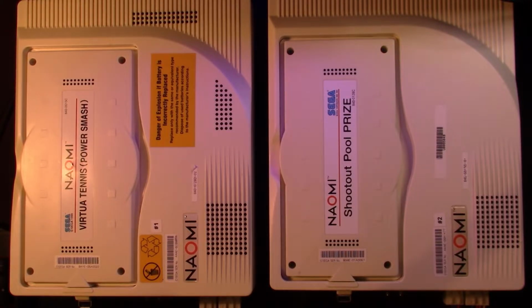That was one of the reasons I was thinking of, for the JVS bridge boards, of getting rid of the power cables I created and using USB, or just telling the user to use USB rather than those, because if they get the polarity wrong, they could damage the JVS bridge board, or indeed maybe even damage the Naomi themselves.